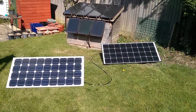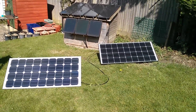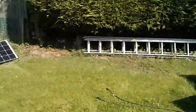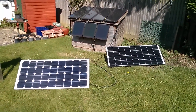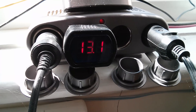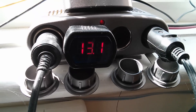The solar panel with the long leads is now on my shed, along with the 100 watt solar panel. Let's check the batteries — now that I've removed the big car battery, which is going to have this 80 watt panel with the shorter leads, my batteries on the battery bank should have gone up in voltage even more with 180 watts. Not 180 watts, of course, because there's no MPPT. Still 13.1 — no change. They must be pretty depleted, so I just have to wait for them to charge.